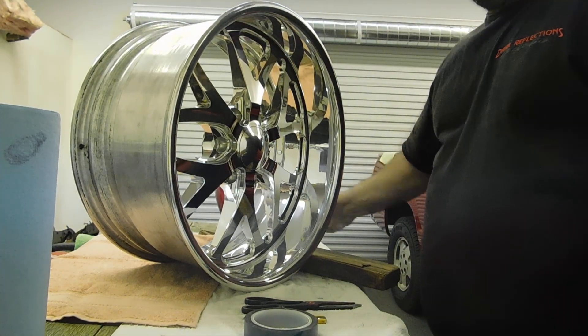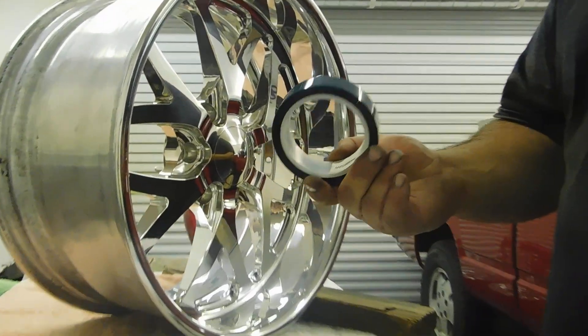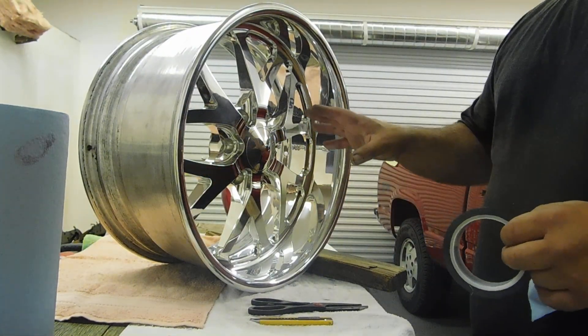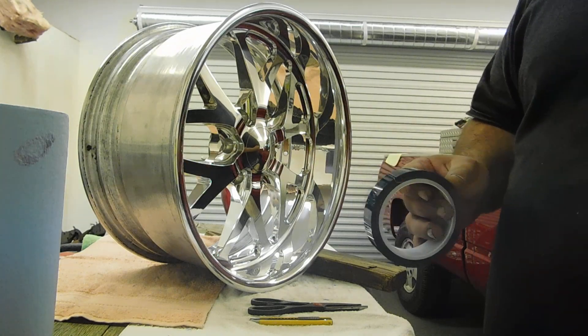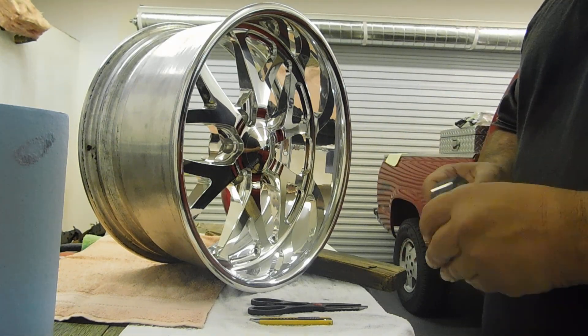This is the tape I've been using — it's a green powder coating tape, available online at lots of different places. I'll leave a couple of links in the description. I've seen it on Amazon, Eastwood carries it, and basically this is a tape designed to withstand the oven cure of powder coat, which is approximately 400 degrees. If you try using regular tape, it's going to burn to a crisp in the oven and you won't be able to get it off easily. This stuff actually removes fairly easily — once the rim cools down to about 100 degrees, you can remove it while the rim is still warm.